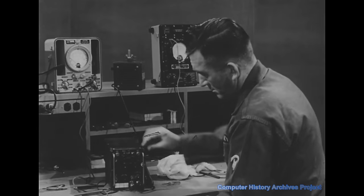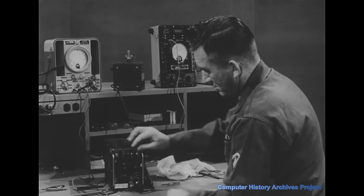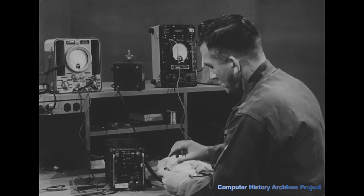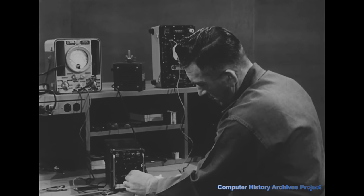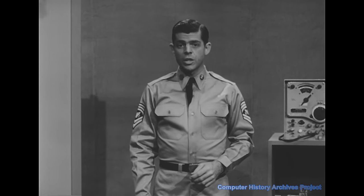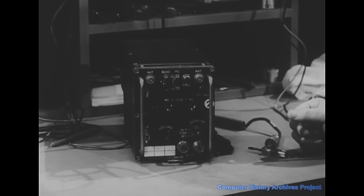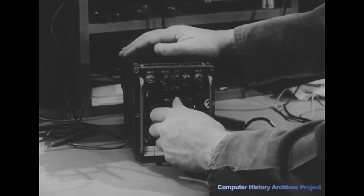For instance, the first step is a careful visual observation. We look for obvious causes of trouble: a frayed cord, a defective plug, rust, oil, or dirt, hardware that's missing or not working properly. Ten or fifteen minutes spent on this kind of inspection is always valuable. It may not only solve the immediate problem but also prevent trouble in the future.